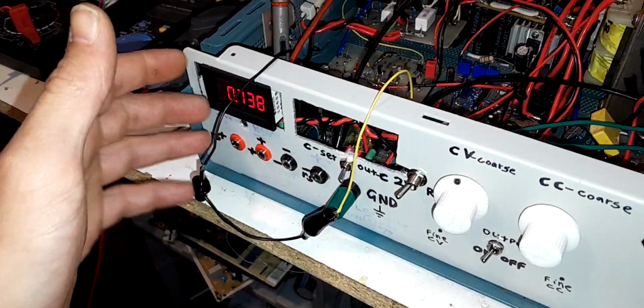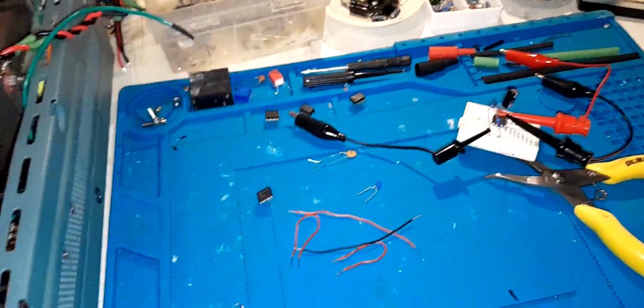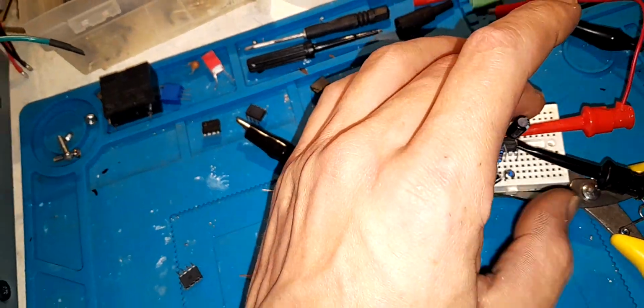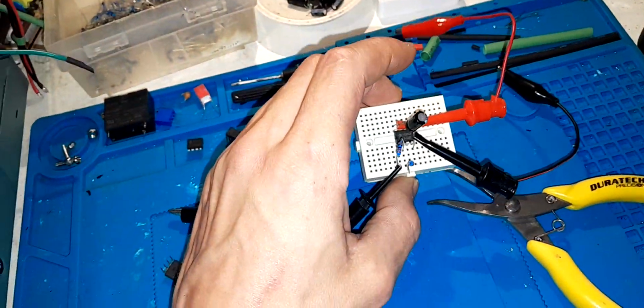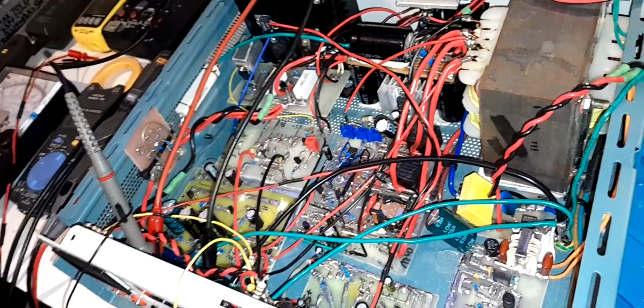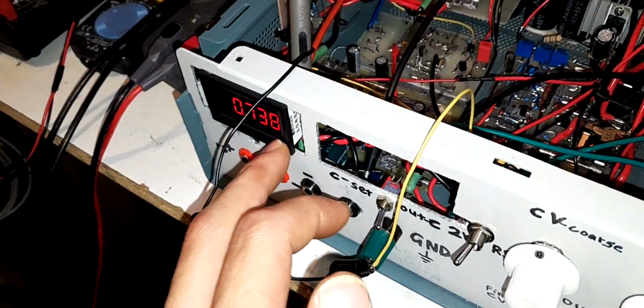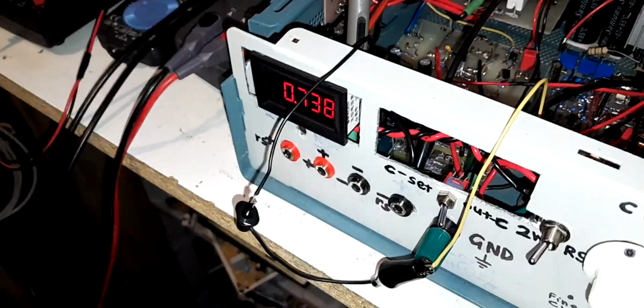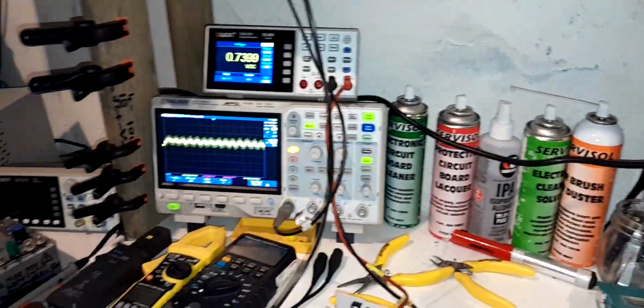So I thought, surely it's just a high impedance input network on that, long wires, something like that. So I did all the usual things, tried decoupling stuff, adding input resistors, capacitors to decouple the inputs, power supply rail caps. I made all the leads shorter until I was down to this. It was still there. It finally hit me. The panel meter is actually oscillating itself. And you know what? If I actually just, this is going to be really janky.